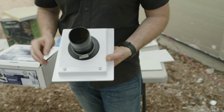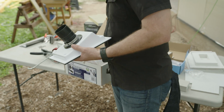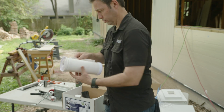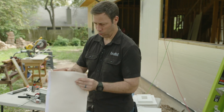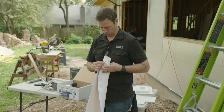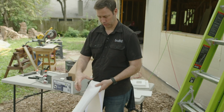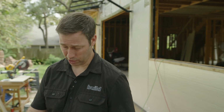And then this is ultimately gonna beautify it and make sure that I've got a spot to mount my Hardie to. My line sets will come through here, and then they include this PVC cap that basically will wrap around my pipes and make them look really nice. And we'll also keep the UV rays off that insulation. So that black insulation you always see on people's houses out to their line sets that's degraded by the sun, I don't want to have that issue. It's going to look nice and white.